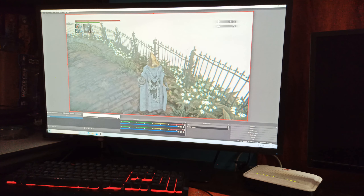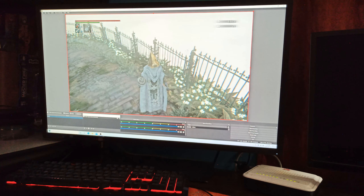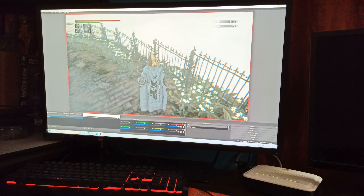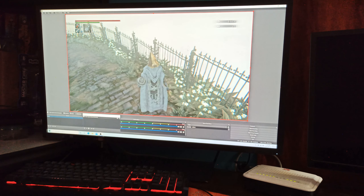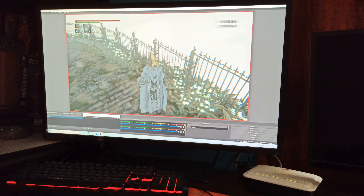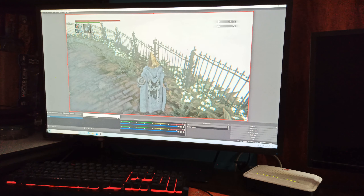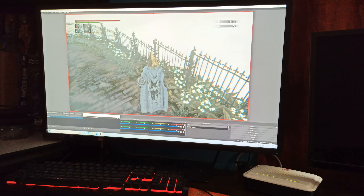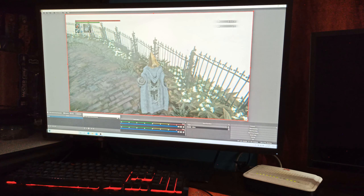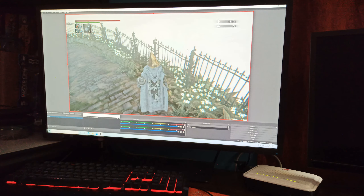This is the inside of the HU30 capture card. Overheating is a well-documented issue noted in many online reviews. The solution is a cheap pack of aluminum heat sinks used for electronics like car amplifiers and graphics cards. Using thermal tape, you apply the heat sink to the back and stick it onto the MOSFET. I've applied three small heat sinks — I skipped one component that sits taller and might clash when reassembling. This should prevent excessive heat during extended use.